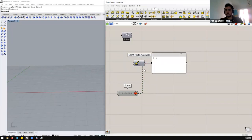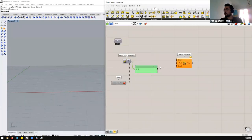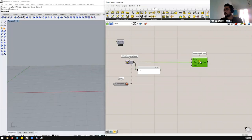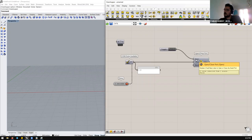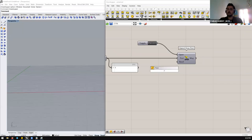If you click on timer and connect it, it will update. Now that my Arduino is disconnected, it's checking each second whether the COM is available. I connect my Arduino and the COM shows again. Now I need to open or close my port — if you have 20 ports, you need to choose which one to open. We need a boolean — true or false. This is important because when you want to upload a new code to the Arduino, you need to disconnect first. When true, Grasshopper connects directly to the Arduino; when false, we're not connecting or updating.